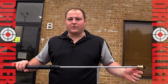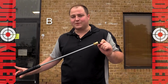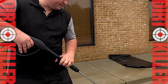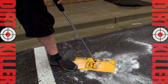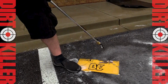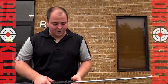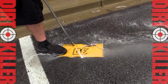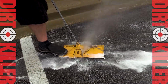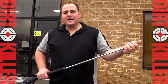Alright, so what we're going to do real quick is do a quick demo on low pressure versus high pressure. Our low pressure soaping tip that comes with that machine is what we're going to use, and we're going to see what effect it has on the cardboard. Let's check it out. No matter how close I get, it's not really doing much. Let's try that again at high pressure. This is the 15 degree or the yellow tip. Pretty drastic difference.